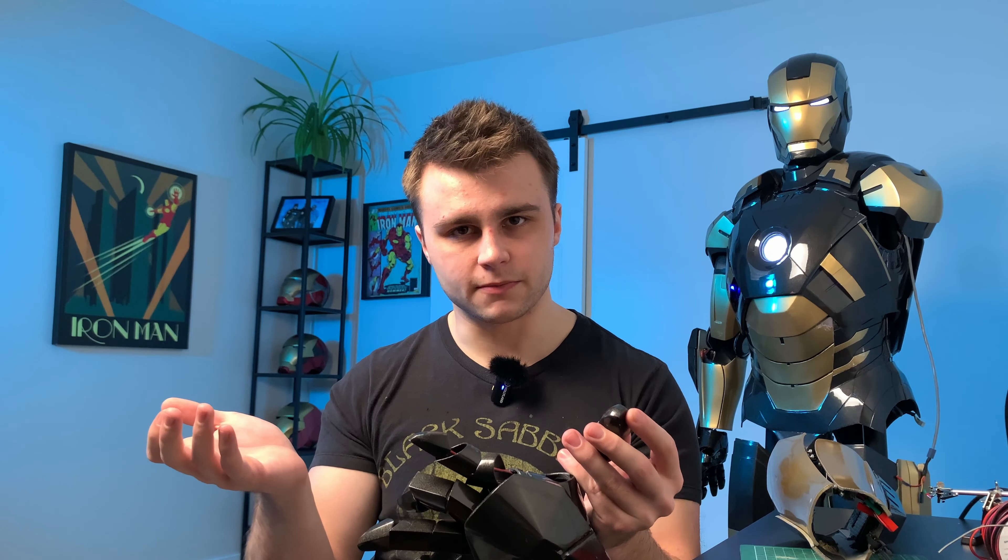The finger tightness is worsened by the reed switches I have in my fingers. Basically I have a magnet in the tip of my thumb and a reed switch in the tip of my finger — bring them together and it activates stuff in my suit. These are 20 gauge wires, not crazy thick, but they still take just enough space that it's really uncomfortable to wear. So instead we're going to completely get rid of the reed switches and swap them out for tactile switches — these little buttons. I'll put one inside my palm, and whenever I bring my finger down and press into it, I can click the button. As the name suggests — tactile — it gives me better feel. Sometimes I'd just be sitting there doing this for a solid minute trying to activate something because the magnet and reed switch weren't making perfect contact, and I couldn't even tell half the time. And on top of that, the wire management sucks.